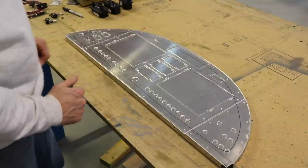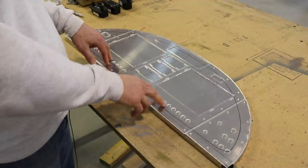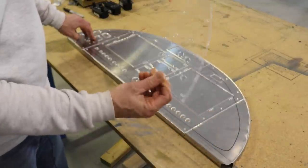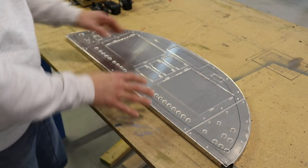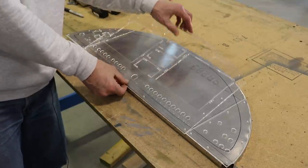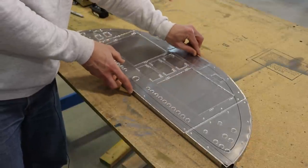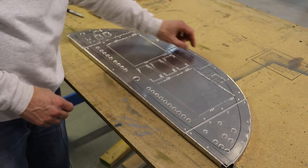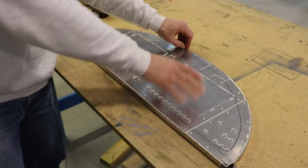Let me explain why I have this cut into three pieces instead of just one panel, and I'm going to show you why having these clear templates really kind of saved my butt. The original idea for the three pieces was the two end triangle-type pieces would basically be bolted in place, and the big center piece with everything mounted in it was going to be mounted with a hinge on the bottom so that it would fold down, giving me access behind the panel. There would be a three-quarter inch lip around the whole panel with the center section cut out.